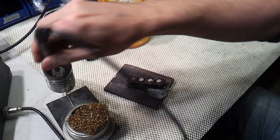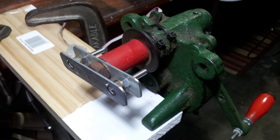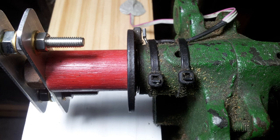Here's the winder I made as a teenager. Over the years, I've built a few others with sewing machine motors and stuff. But I'm trying to keep it simple in these videos, and this actually works very well. It's an old hand-cranked sharpening wheel I found at a garage sale or something. It's geared about 9:1, so it hums along fairly quickly. A typical core will only take 5 or 6 minutes to wind with this. And for hobby stuff, that's really all you need.